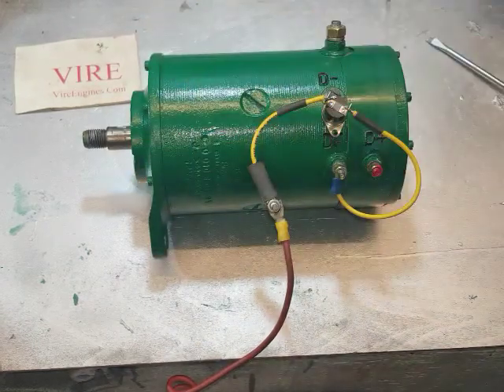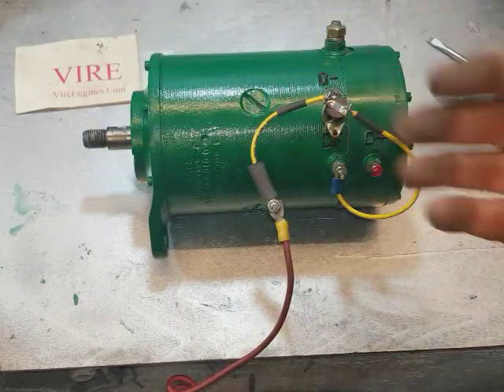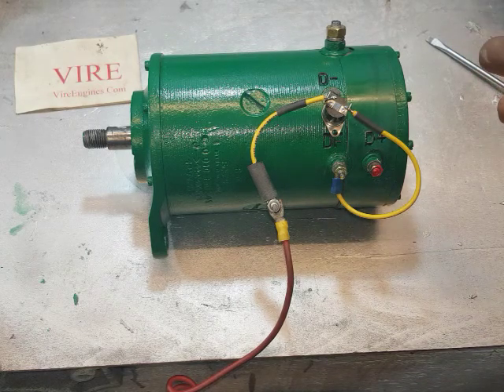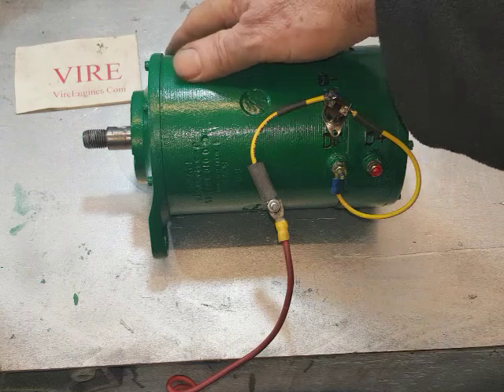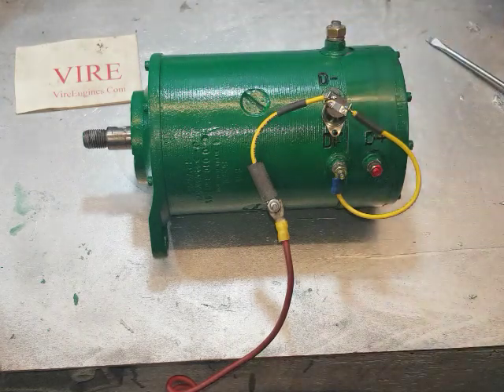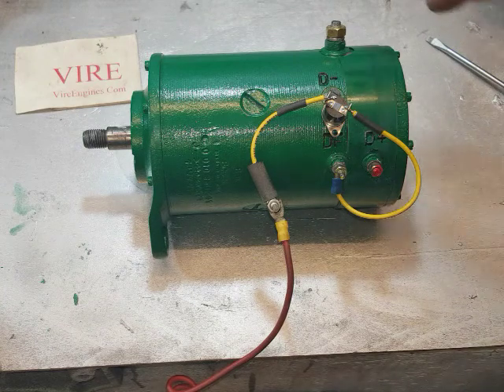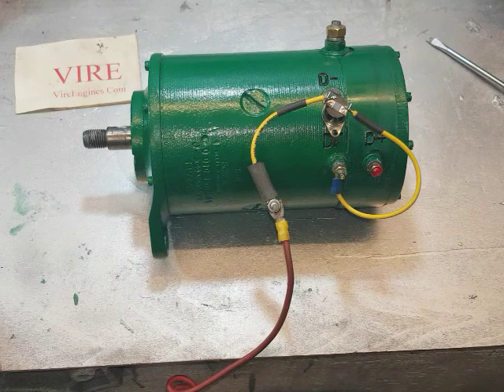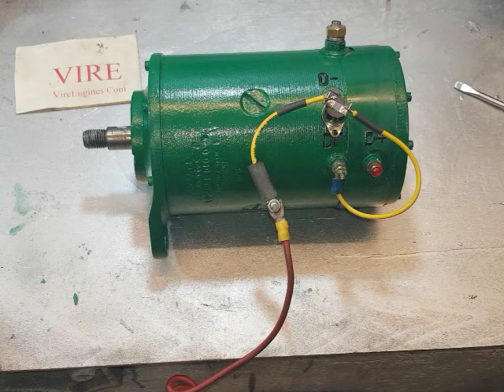Remember, this is not an air-ventilated unit - it's marinized, so you don't have salt air going through the windings to cool them like you would on a car alternator. The downside of that lack of ventilation is it's relying upon the steel in the body to radiate the heat. Originally they're only designed to run at full charging power of about 10 amps for 10 to 20 minutes.